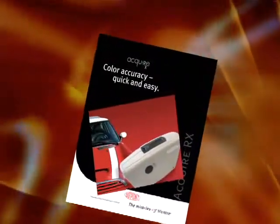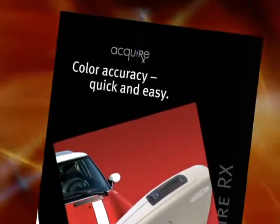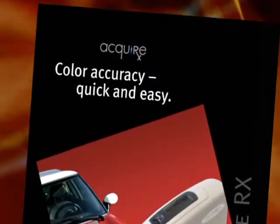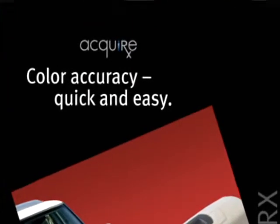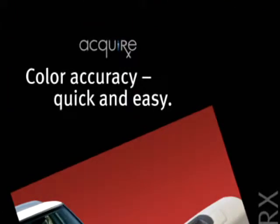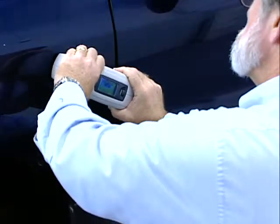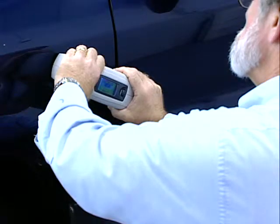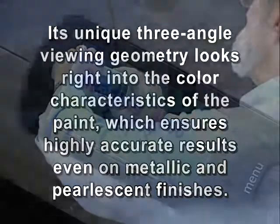Finding the best color formula is easy when you have the right tools. Acquire RX, combined with DuPont's ColorNet, are designed to provide a totally automated and convenient formula retrieval process, so you can find the color you need quickly and easily. Simply place the Acquire RX directly on a flat, polished surface to take a reading of the color. Its unique 3-angle viewing geometry looks right into the color characteristics of the paint, which ensures highly accurate results even on metallic and pearlescent finishes.